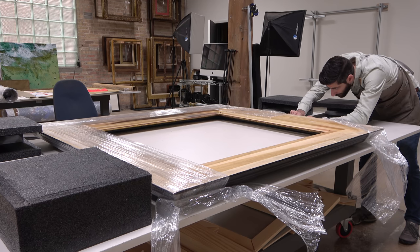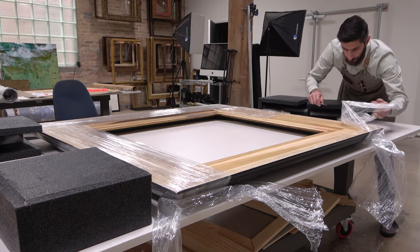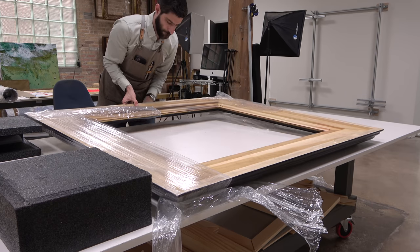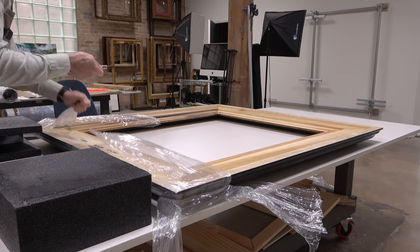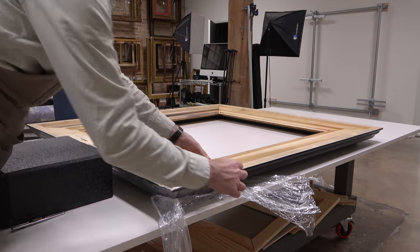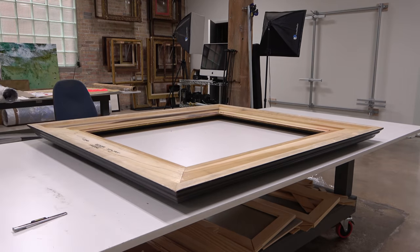After fabricating the machine, the Ripple molding can be created. But that is only the beginning, because the structure of the frame must be built, assembled, and then the finishing process — arguably where the art comes into frame-making — takes place. Dutch interiors of the 16th century lacked an abundance of natural light, so dark and modest frames were preferred so as not to distract from the paintings. Hand-burnished black over red clay with a patina and minimal gilding will speak to the Dutch golden age of painting.